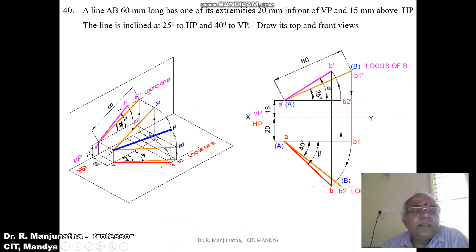We need to draw the top and front views. We know this is the true length in the vertical plane, so the line has to be parallel to VP. When you look from the top view, B1 is in front of VP by 20mm and A is also in front of VP by 20mm. The image falls on the horizontal plane as AB1, and since the line is parallel to VP, its corresponding front view A dash B1 dash will be in true length.